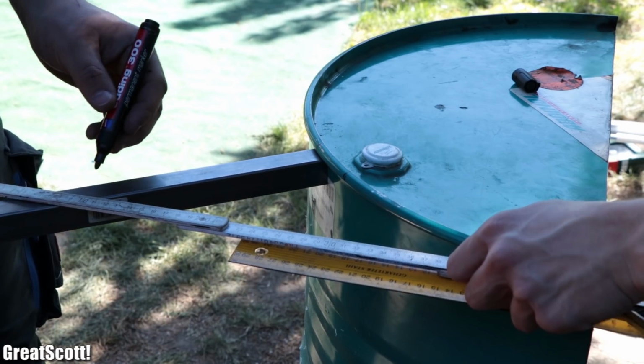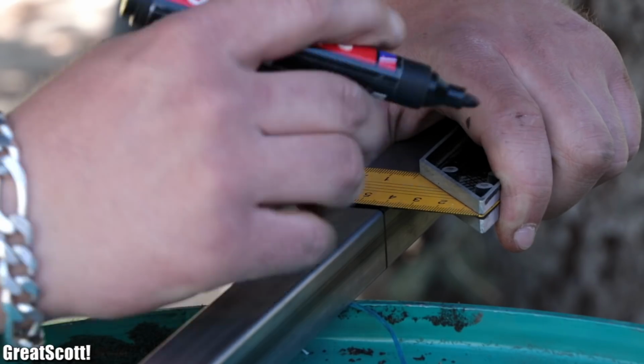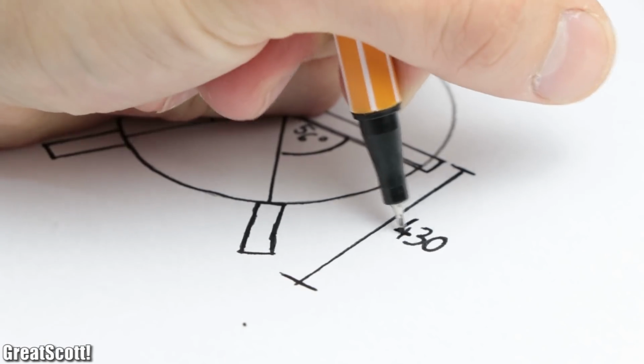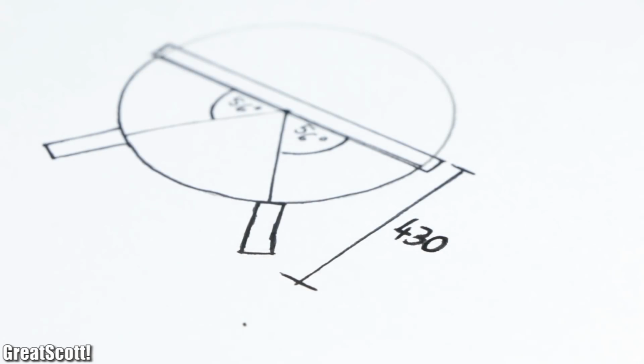That means we could mark a fitting length on one of them at that angle, and thus mark this 20.5 cm length onto the 3 other square steel pieces, in order to reach an overall height of 43 cm for the coffee table.